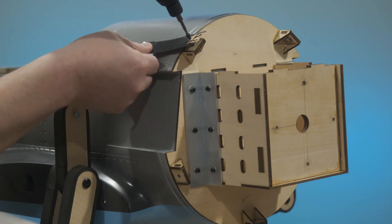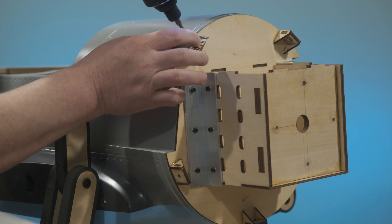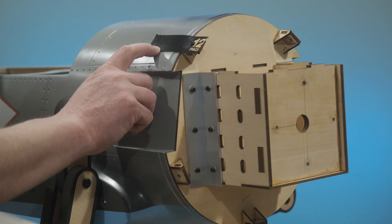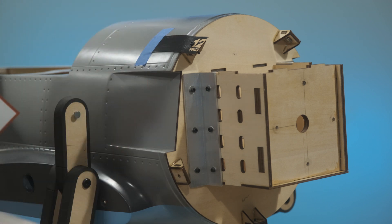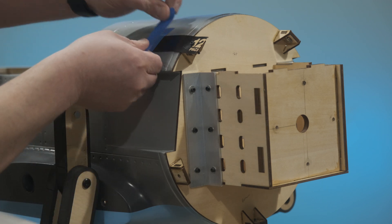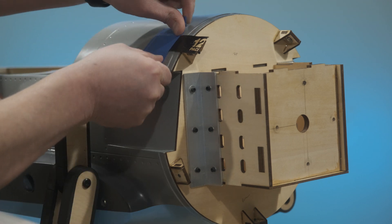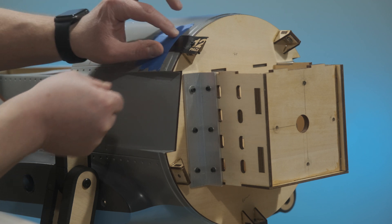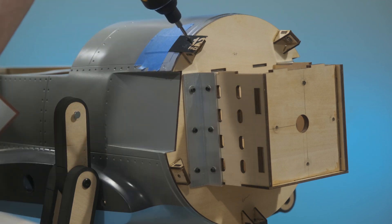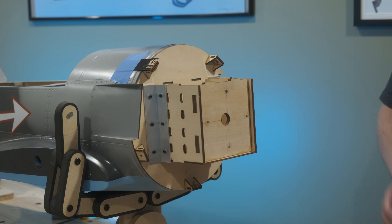Let's cut a piece of cardboard out and mount it to where we're going to drill the hole, and then securely — and I can't stress this enough — securely tape it so it doesn't move whatsoever. This is going to be your guide. As we're taping this up, you can see there's a little lip around the front of the fuselage. That is actually helpful because when we put the cowl on, it fits right on that lip and there's no guesswork about whether the cowl is too far back or too far forward — it fits right in that little ridge.